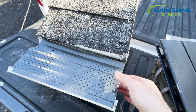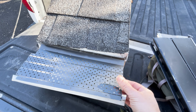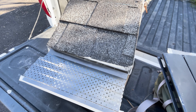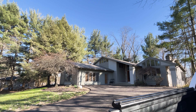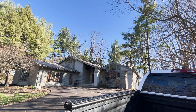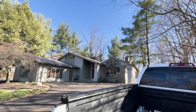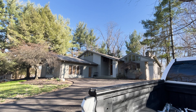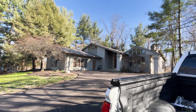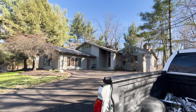This is my display box. I have a 6-inch gutter, a little roof sample, and the gutter guards that we show folks. We'll typically show four or five different gutter guard systems. We use the criteria of what kind of trees do you have and what's the proximity of those trees to your house. You can see the proximity of these pine trees to this house. There are also some deciduous-type trees off in the distance and along the property line. The reason I'm at this house is because they're tired of cleaning the gutters — no real emergency, but they're simply tired of dealing with it.